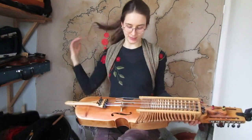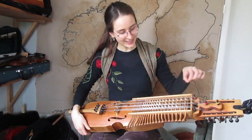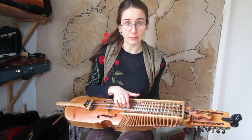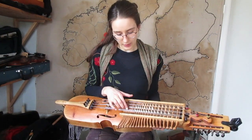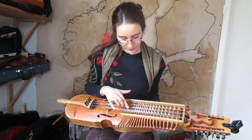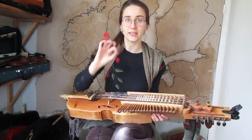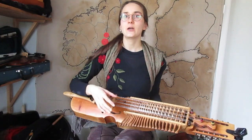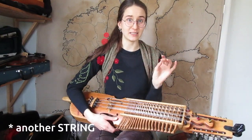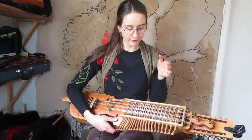I've actually been at it for a few hours and the carving fix didn't work — kind of a bad example, but still interesting. I think my resonance string is actually hitting on another string, which is much harder to fix as I explained at the beginning. I've carved pretty much all the tangents and it's still buzzing. When a resonance string hits a tangent, the sound tends to be short and sharp; when it hits another string, it's more resonant and a bit more metallic.